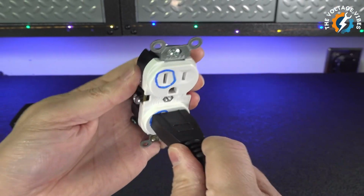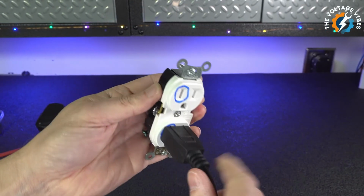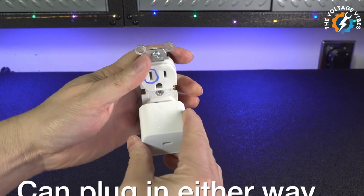Now, what about three-prong plugs with identical prongs? These aren't polarized either, but they have something else: a ground prong. The ground prong prevents you from plugging the cord in the wrong way because it only fits one way into the outlet. This ensures the hot and neutral lines are in the correct positions even without a larger prong.